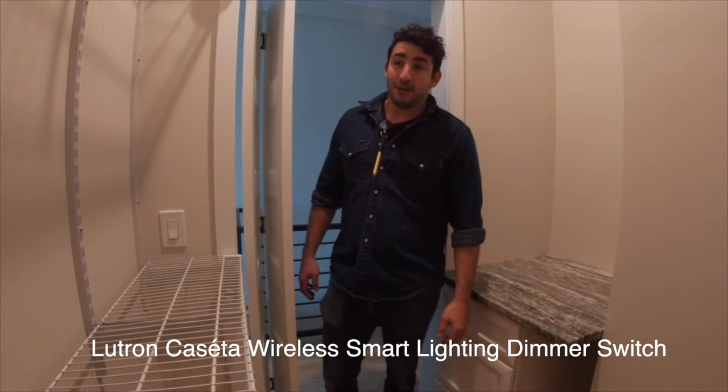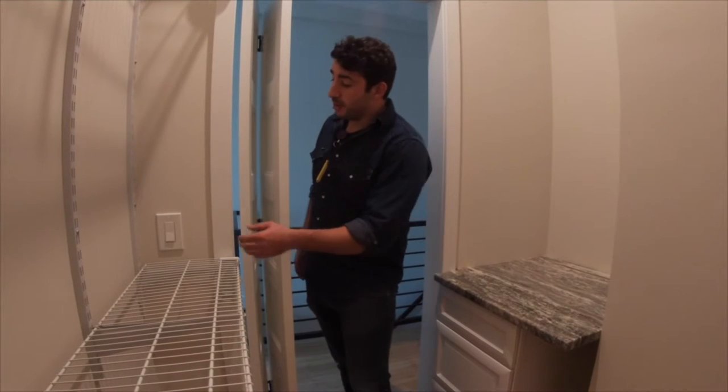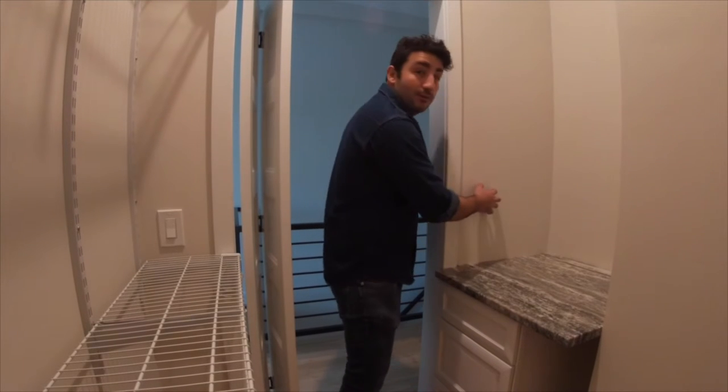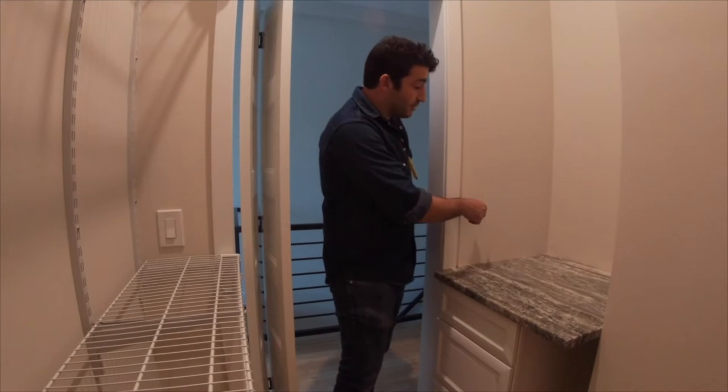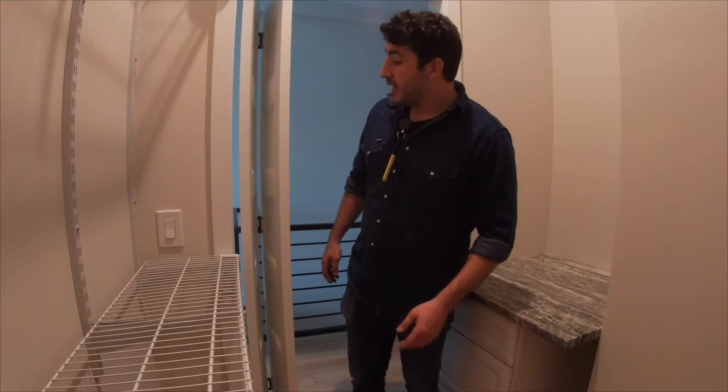Lutron makes something called a Pico switch, which couples with their Caseta switch. I'll put a couple links in the description to where we get it. We use them a ton. It takes about 20 minutes to install. You put a receiver here, and then you can put a wall-mounted bracket here with a switch that looks just like a regular light switch. It takes about 20 minutes, no drywall dust, nothing.